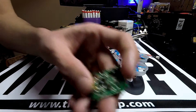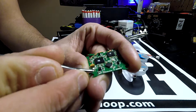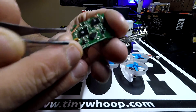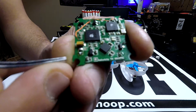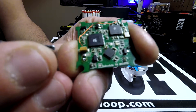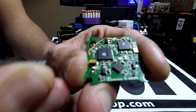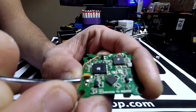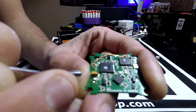So here we are down at the bench. I want to show you guys what the proper setup is. The outside of the board is your negative and the inside contact is your positive. So this is your negative and this is your positive. For the sake of this video, I'm going to hook this up backwards and show you what it looks like when you apply reverse polarity. The main cause of people doing this backwards — beyond the fact that we have a lot of new people in this hobby, and it happens even to the best of us — is that the Inductrix FPV comes with two battery plugs: one that goes to your camera and one that goes to your battery.